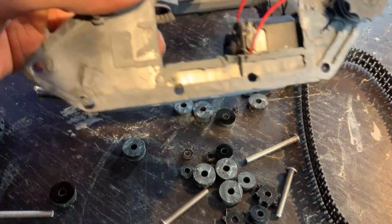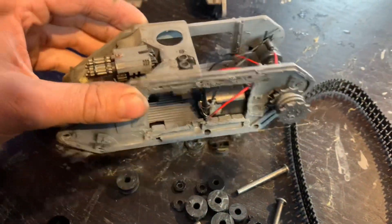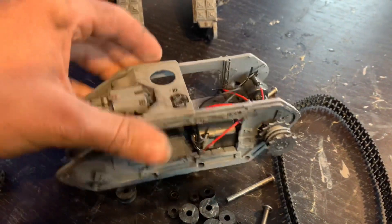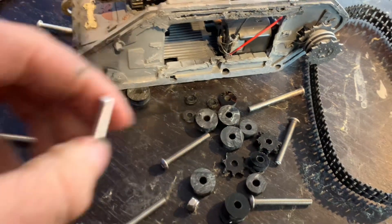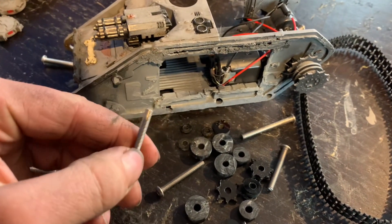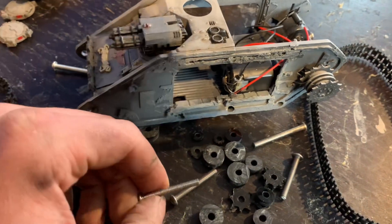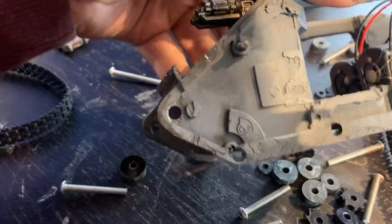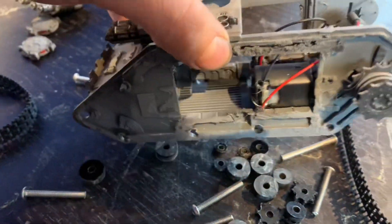I then marked and drilled holes in the side so that an axle can go through both sides of the inner middle and the top cover and outer sides. That way I could put some small M4 Allen key bolts through to act as mini axles. There shouldn't be too much drag — it should work fine with the motors involved. I did also have to get rid of the front mechanism for the door as it sits in the way of where the tracks would run.